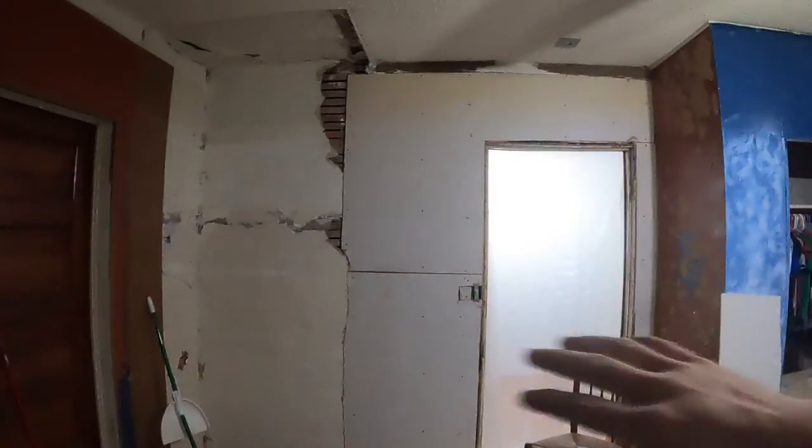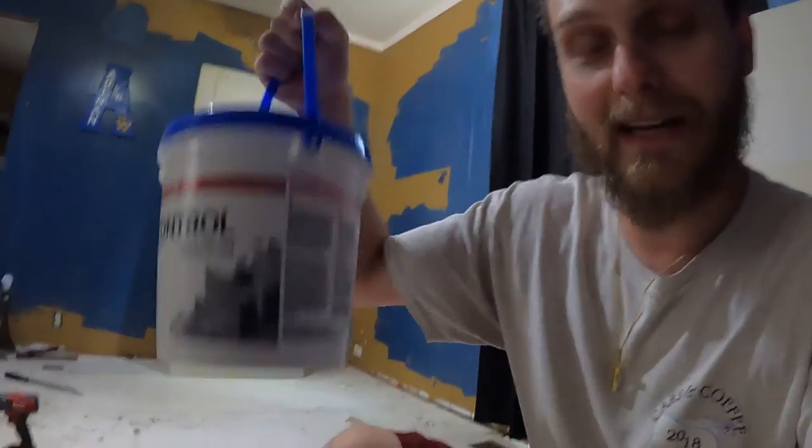Alrighty, welcome back. As you guys may know and have been following the project, we have the boys' wall done, and we need to start mudding. Now, here's the thing with mudding, you need a couple things. I didn't mention this in the last video, but just in case you're new, we'll catch you up real quick. We're going to need some fiberglass tape, some little scrapers, little mud scoops, a pan for the mud to go into, and, well, I keep saying mud, you're going to need some of that.